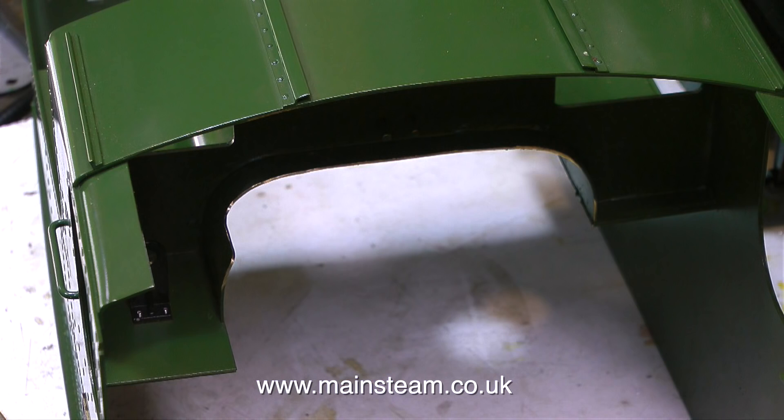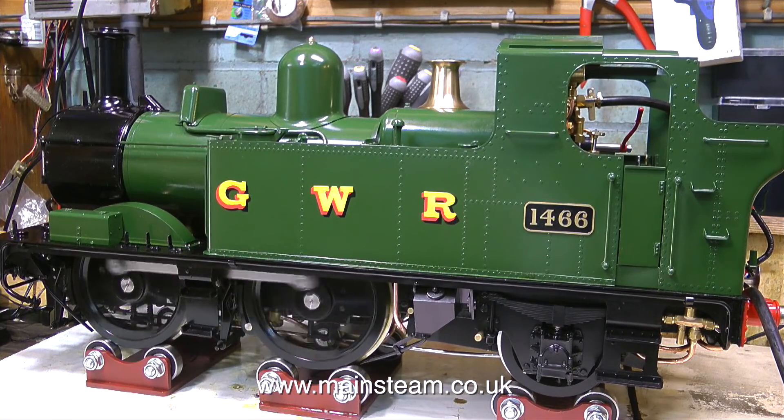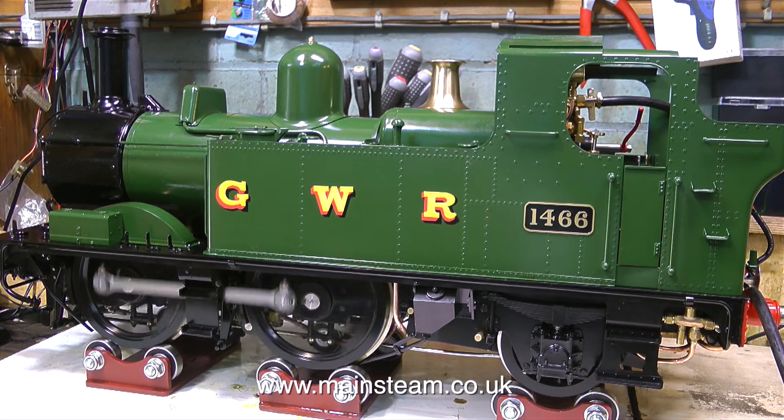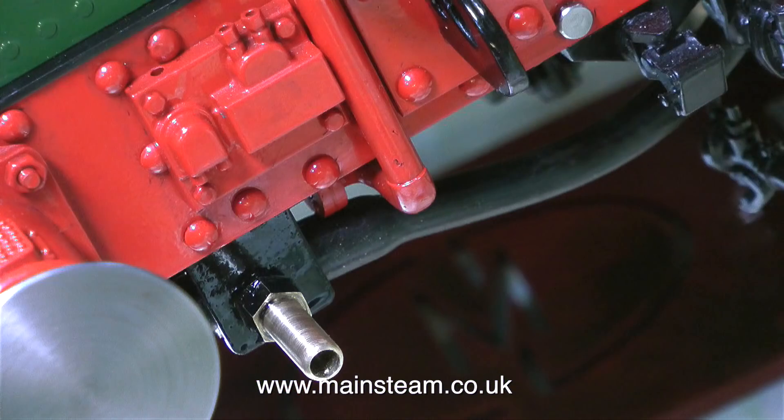Now it looks like this — quite smoothly cut. So now the superstructure fits on the chassis, which is always a good thing. The locomotive looked pretty much like this when I first bought it, but now it really is fairly completely different at the cab end. This is the injector fitting I made for the feed water, because originally it was just onto a very small union which tended to restrict the flow of water. But this one will be okay.